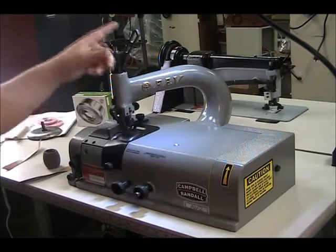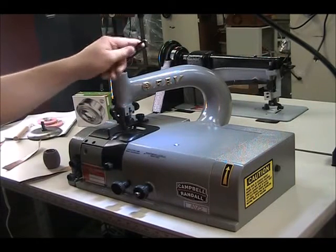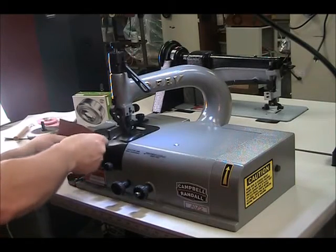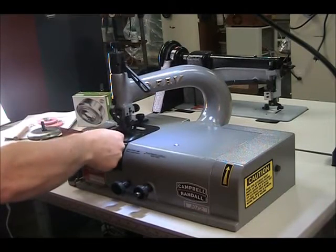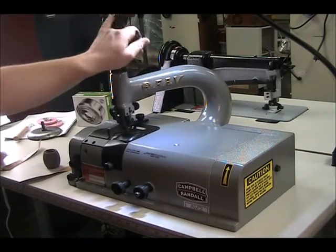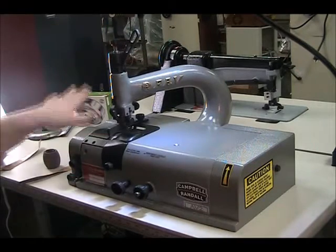Now, when I'm using this, this is to engage the mechanism and release the mechanism. So first I'm going to do all my adjustment with it down, get my gap set like I want it, and then I do my skiving. And if I have a part that's difficult to get in, I can drop it in like so, and then let it pull into the knife. You don't have to use this. This is an option. You do raise and lower, similar to, if you're in the sewing world, lifting the pressure foot to put material underneath, or you can just push it right on through.